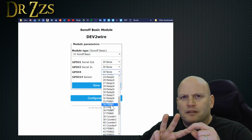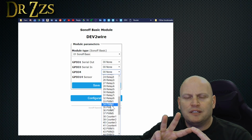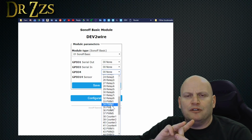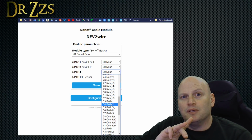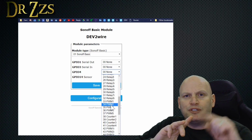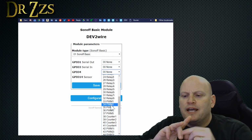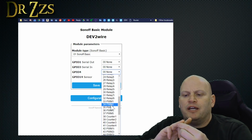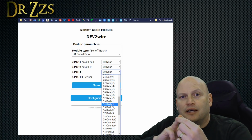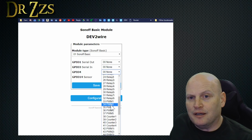And so what you do is you take one end of the 12 volts that would go to your LEDs, and then the other one will go to your LEDs. And then that middle pin you connect to this PWM GPIO pin. Essentially, that GPIO pin will send little waves, and it'll change the waves based on what you set for your dimmer. And then that will vary how much voltage, or how much current, I guess it is, right? It goes out the other end and to your LEDs, and that's how it dims your LEDs. But again, Rob's got a great explanation.